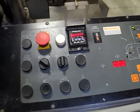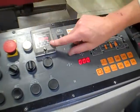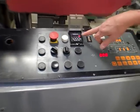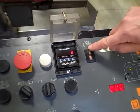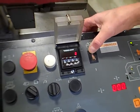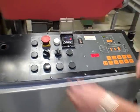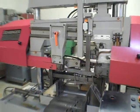That's what it's going to go to for the batch counter. In about ten seconds it'll revert back and start at zero. We'll leave that go for a few seconds. I'm feeding out once — there's our zero. We've got one feed out, which is just one off. If I click this up, we can do multiple feed outs. But for the sake of the video, we'll do one feed — it'll go up to four parts and then shut off. So we flip it over to auto.